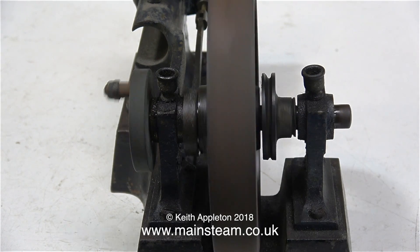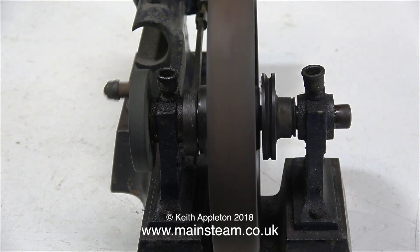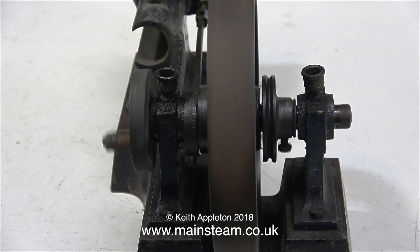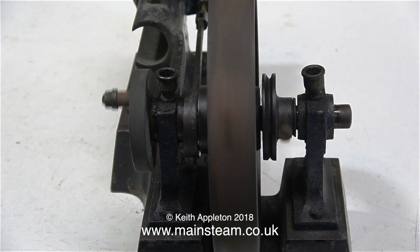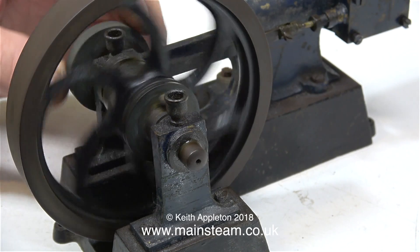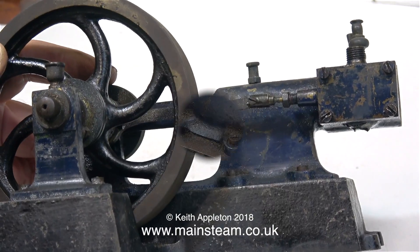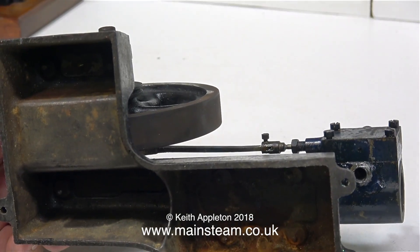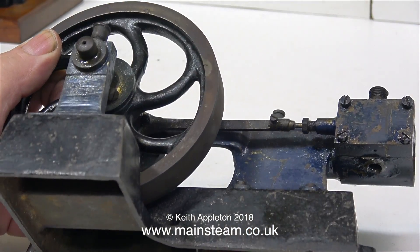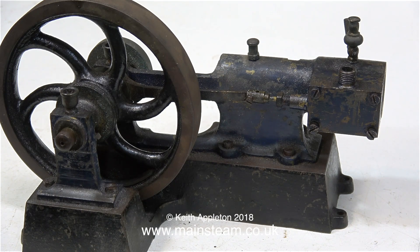As a general assessment of the engine, it really is not too bad — it looks horrible, I know. The flywheel run-out is down to a minimum. I'm putting the pulley in the bin and I'm going to make another one. It looks to me like the person who built this engine was not the same person who made the pulley. In common with the first engine I showed in the video, the basic design is good because it's exactly the same model. The base is cast iron, and the other cast parts are made from gunmetal, or maybe brass.